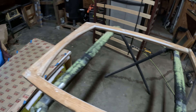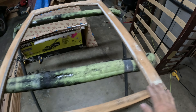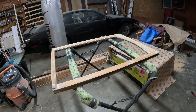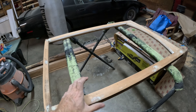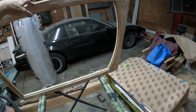I'll prime this tonight and tomorrow put the glass in, then glaze it, then work on the other one. I only did the top sash today — worked on it for a few hours. This one was quite a bit of work to fix because it had that piece that needed to be repaired. That's how you fix up these window sashes. Once you get this base solid, it'll last another 50 years or so — actually indefinitely, as long as you just keep painting it and keep the wood from rotting out.